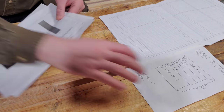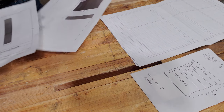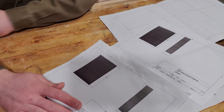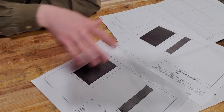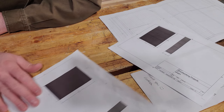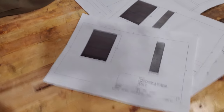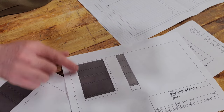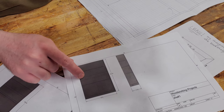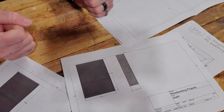She gave me this plan, and then I went home that night and did a couple of quick basic ideas for a bookshelf on a computer because it was quick and easy. What I started with was a more traditional design with a bar in the middle of the bookshelf, because that protects it from racking. That is a necessary part.